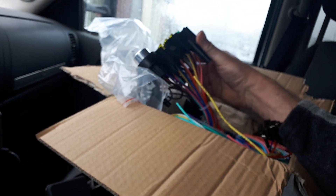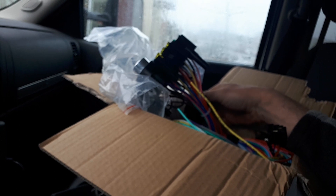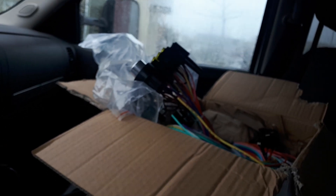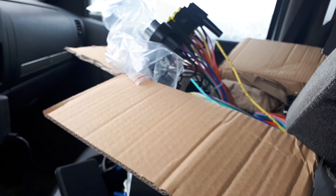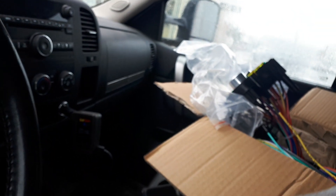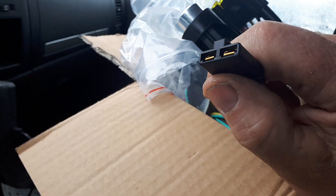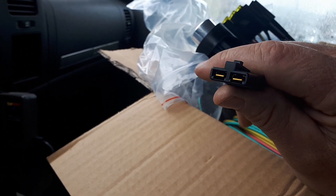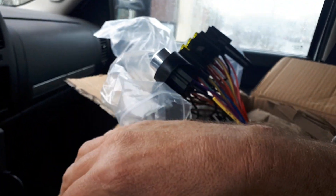Solenoids are available and not expensive, and I think I have some 12-volt solenoids already. We also have to switch the alternator, which should be easy — I've got two or three alternators and one of them is good. I'll need to reclock it since it's clocked for a weird setup. It's a two-plug unit, and this plug here will fit right in. I'll need to make some mounting brackets for the engine block, line it up, and probably buy a shorter belt since the generator has a big pulley.